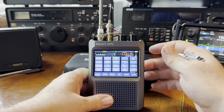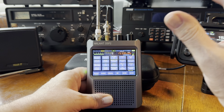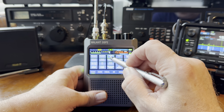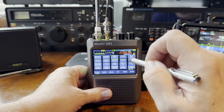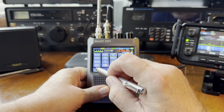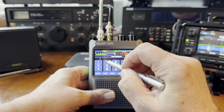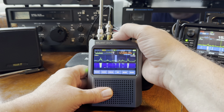My initial tests were that in some meter ranges or band ranges, the Wellbrook was useless because it was just nothing but bleed through, 100% across the board. Even if you turn this down to like 2, you're still getting bleed through. So currently right here in this 15 megahertz range, it's working great. I was having poor results in the 11 megahertz range. So let's tune this. Go 12 megahertz. And then let's just see what's going on.